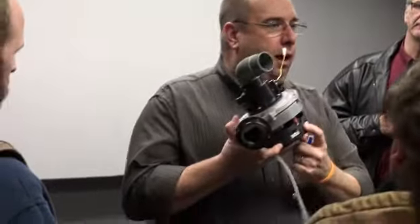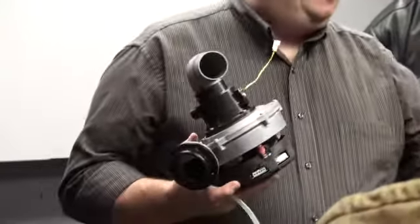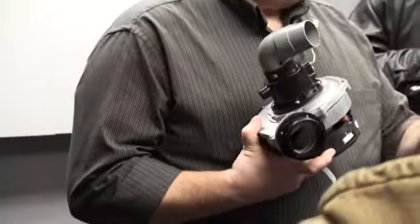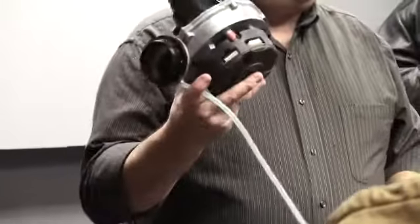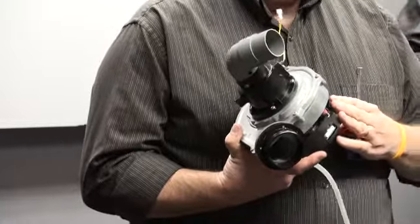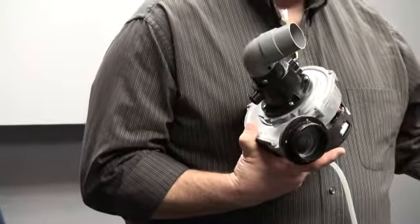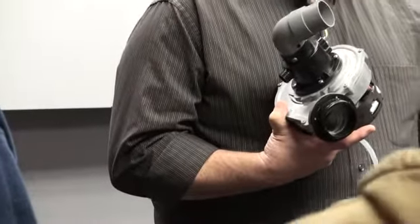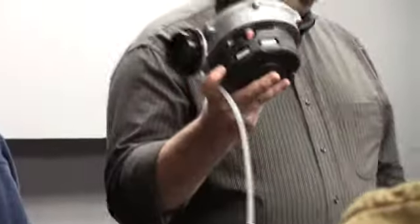You're going to see a three-prong plug and a five-prong plug on this fan. Any ECM fan in anybody's machine does the same exact thing - you bring 120 volts to it, then it converts it to DC voltage for your modulation rate. So if you want to know if your fan is good or bad, pop the three-prong off first and make sure you have 120 going to it. If you do, plug it back in. Then unplug the five-prong - the fan should go to full RPMs as soon as you unplug it. If it doesn't, you have a bad fan. That works for any ECM fan - unplug the five-prong, it should go to full RPMs. If it doesn't, replace the fan.